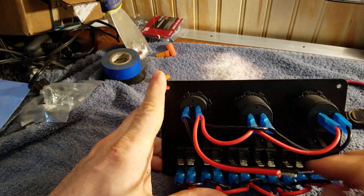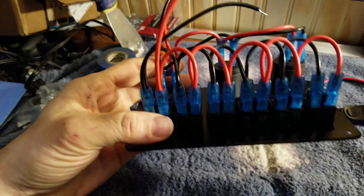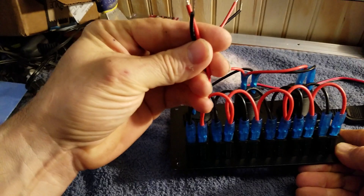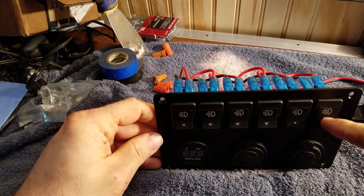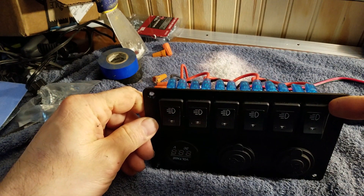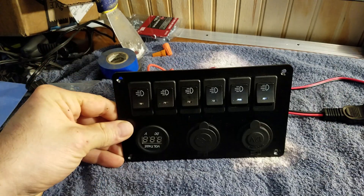The back is where it gets interesting. The three guys up top are all controlled by one power source. What I don't like is that all six switches are daisy chained together and run on one power source, so you have to limit your voltage across all six so you don't blow fuses. A good standard fuse is probably 30 amps, and you divide that by six — that leaves you five amps each if you use them all. That's garbage, I don't like it.